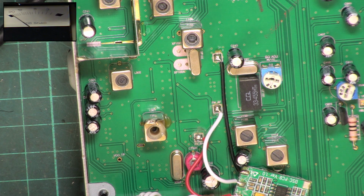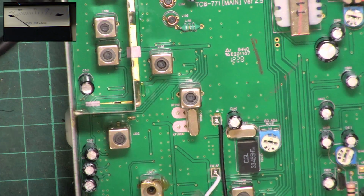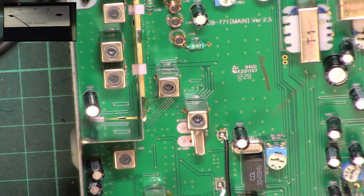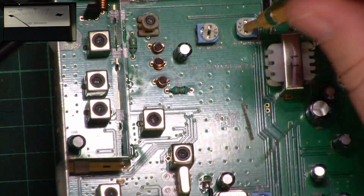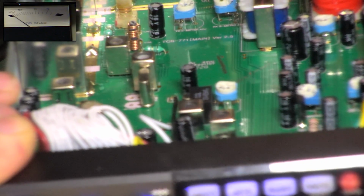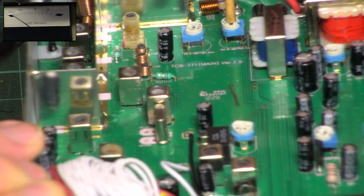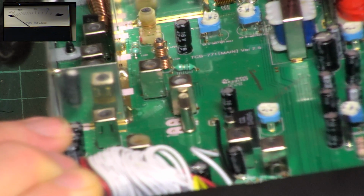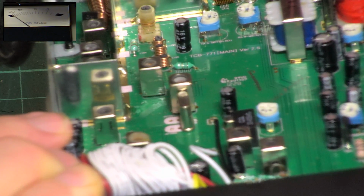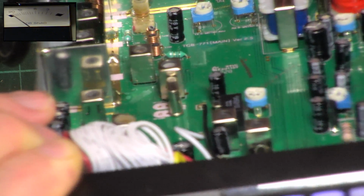So we'll look at S9 once again, and we'll see whether that meter can be set to read S9. At the moment, it's 1356. So these are labelled, and RX meter adjust is the one there to the right at the back. These are in twos, so don't think there's as many degrees of display as it looks like. You see them dropping off in twos as I turn it down. In fact, the first one, 2, 4, 6, 8, and then we can get up the plus 30. So we've now calibrated that to more or less how I want that to be.